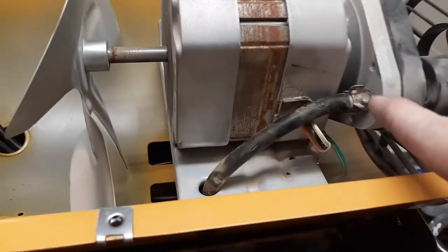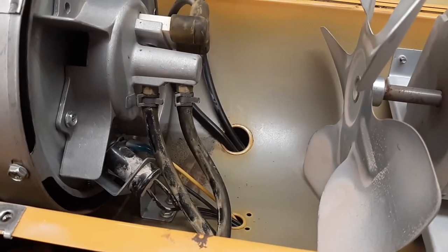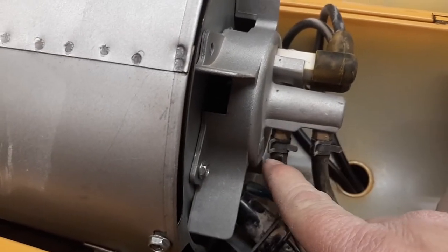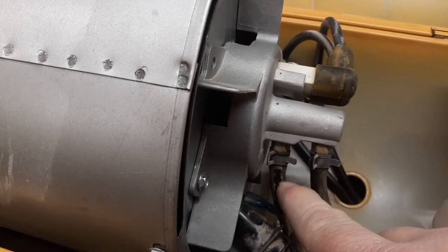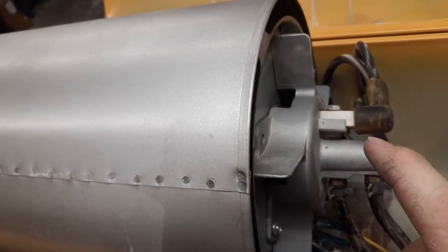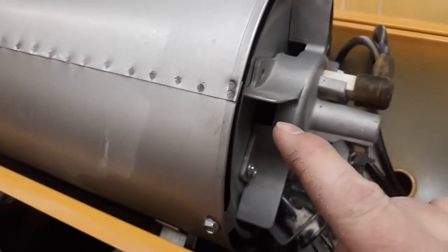Alright, so I cut that small section out and put the hose back on. I went ahead and turned it on and it's still doing exactly the same thing, but my fluid pressure does seem to have increased — you can tell by the amount of excess fuel blowing out of the front of the machine. I'm thinking possibly the nozzle is clogged or distorting the fuel being introduced into the chamber, so it's not getting good contact with the igniter.